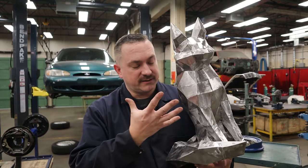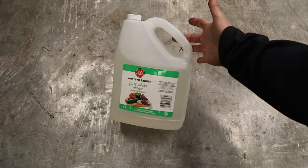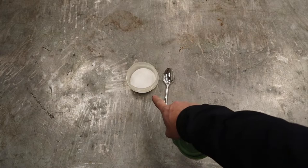So some parts rusted and some parts left polished — that's what we're going to do in this video today. Rather than waiting around for months and months trying to get this thing to slowly patina up, I did a little research and figured out a way to get this thing to rust up instantly. To make this super fast rusting concoction you're going to need some materials from the grocery store: the first one is pure white vinegar. You will also need a 500 milliliter bottle of hydrogen peroxide, and you will need just regular table salt — about one teaspoon worth.